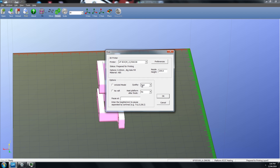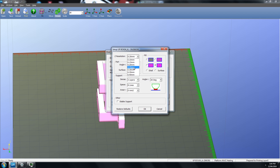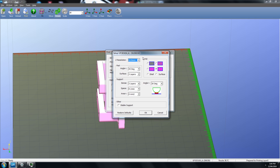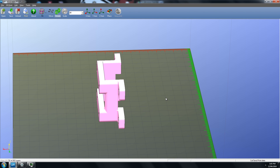I'm going to go to Print. Quality: Fast is fine. Resolution: 0.25 — the quality is not too big a deal and 0.25 is always a decent medium. Fill: Dense, because it has to be quite strong. Support angle: I'll just go with 30. And that's pretty much it, so let's hit OK. It's going to slice it — 192 layers for the UP Box — and send it across.